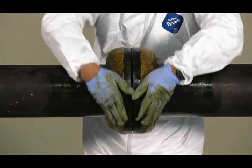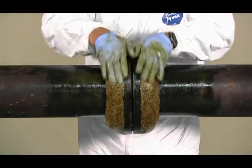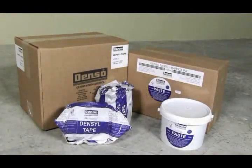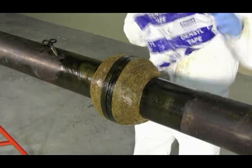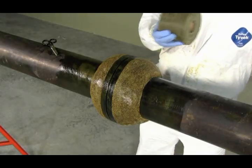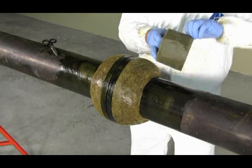You may apply a small amount of Denso primer to a gloved hand to help in smoothing out the profiling mastic. Denso's petrolatum tape system includes a full line of petrolatum tapes, primers, and sealing mastics, which began over 80 years ago with the development of Denso tape for the long life protection of buried steel pipelines against corrosion.